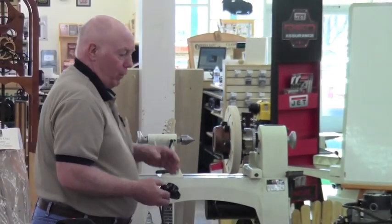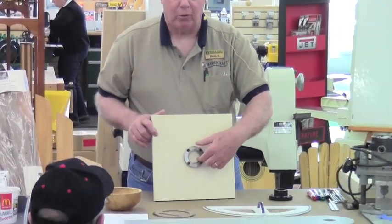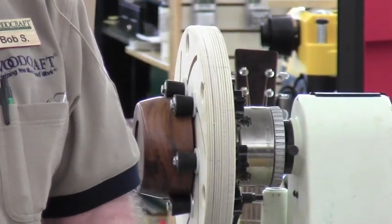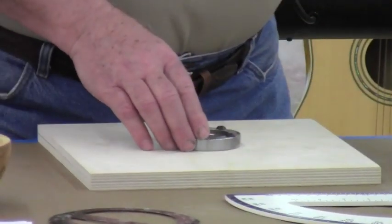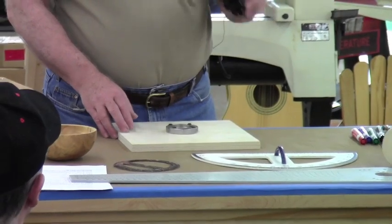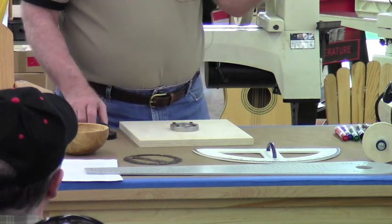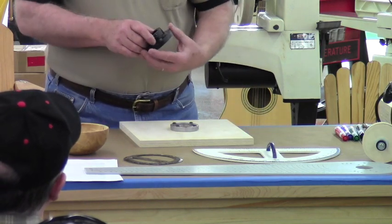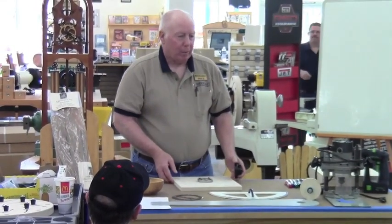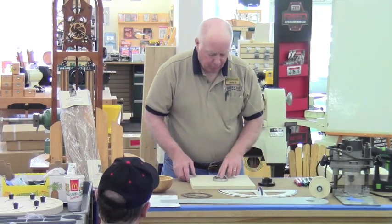Then you have your choice of what's called a face plate ring — a lot of turners don't know about these. This is just a ring with dovetails in it. I've taken a regular four-jaw chuck and expanded into that, and that holds it. Once you put a face plate ring or a face plate on this Longworth Chuck you're building, you should dedicate it — don't take it off. The nice thing about the face plate ring is you can go from one lathe to another without regard to spindle size. When you use a face plate, you're stuck with an inch and a quarter by eight turns per inch, so that Longworth Chuck can really only go on one size of lathe. My preference is to use a face plate ring.